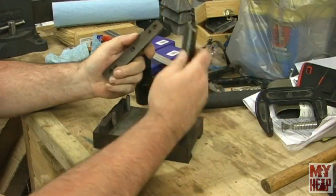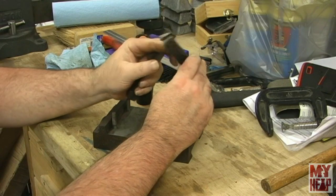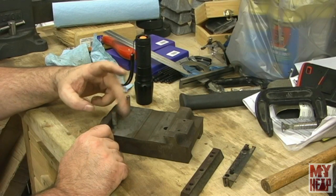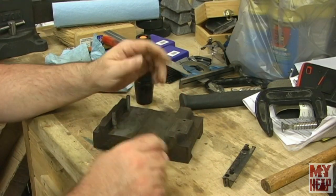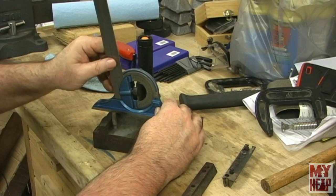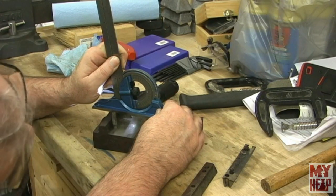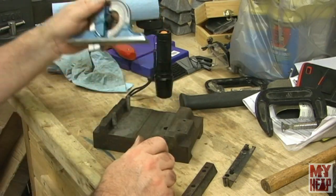I have the saddle over here. This measured 80 degrees, this measured 60 degrees. This one here is sort of close to both but not quite right. So I think what I want to do is verify the 80-degree angle off of this side of the carriage casting — and of course this side we know is 60 degrees. I take the protractor, put a flashlight behind it, and bring it up until I see no light. And I see that I'm on 80 degrees — it is in fact 80 degrees. So I have a little bit of a dilemma: the knee gib spacings from the side are different than what they need to be on the saddle, and you can't take any measurements off that other one because it's junk — that's a piece of steel, not cast iron. Somebody made this; I'm convinced of it.